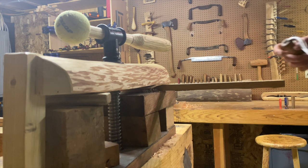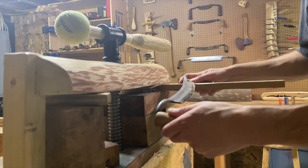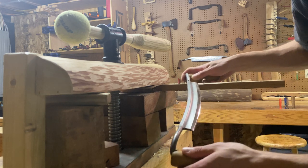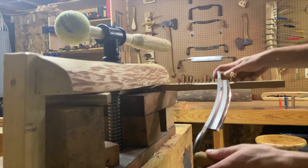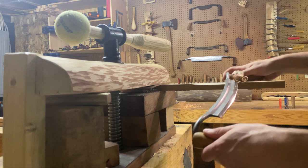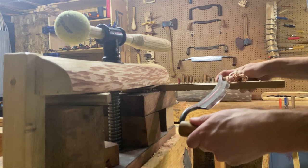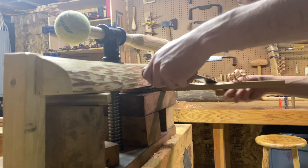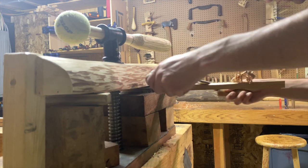I'm using the carving tools that I like, and you should use the ones that you do. There's no reason you need to use a draw knife, or chisels, or any other tool, for that matter. You could even cut this out on a bandsaw. If you're not very confident in your tool use, I would do this with files and rasps, something like a Shinto rasp. Same goes, by the way, when you round the corners to make the barrel slot. There's no reason you have to use a spokeshave like I did. Even sandpaper will work, or just rasps and files.